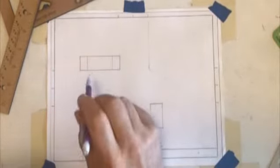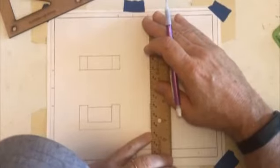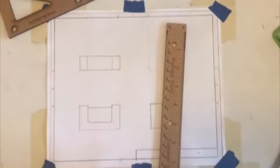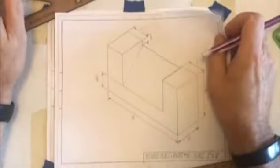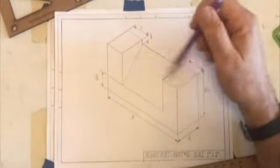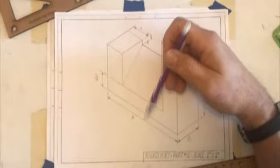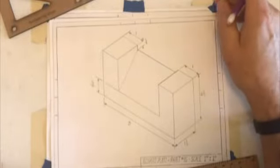I'll take my eraser shield and put it where I can get that line marked, then do the same on the outer edge. We've completed our top, our front, and our right views. I may want to darken up the object lines a little bit on the outside edge. I just broke my lead — it's funny we call it lead when it's really graphite. Now, I'm not doing a reduction factor on these drawings because they're pretty simple. But in a normal isometric drawing, we would do what's called a reduction factor — two and a half times 0.866 — to calculate the reduction of the part size. That's what a true isometric drawing would be, reduced to 0.866. That's detailed in Mr. Walker's book.